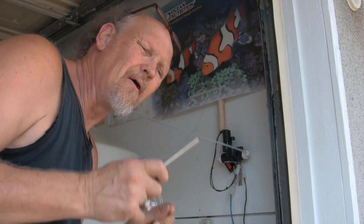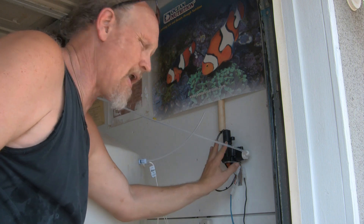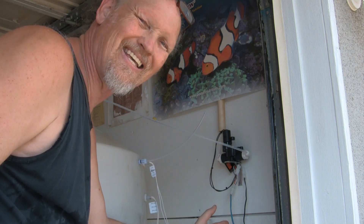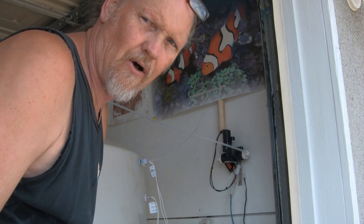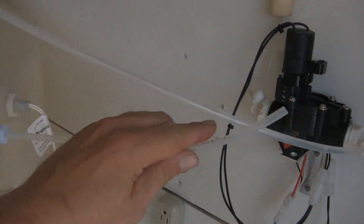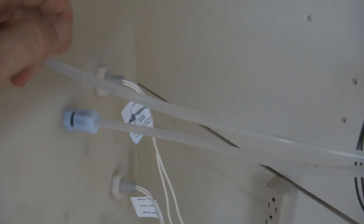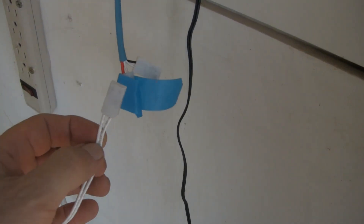While I really didn't relish the thought of having to disassemble all this on a hot Sunday morning when the humidity is way up, there are some silver linings. Yesterday we had mounted the solenoid valves as well as the power strips on the wall — turns out they're directly over a power outlet. So this gives me a chance to move all of this over about six inches so that any leakage of water doesn't end up directly onto the power itself. I made it a point to mark which float switch was the top, so I'm okay there.